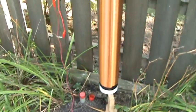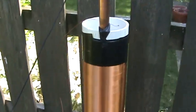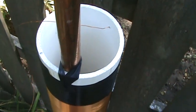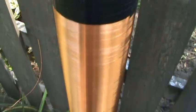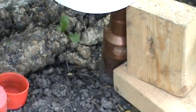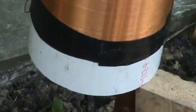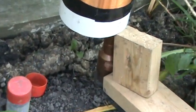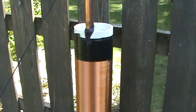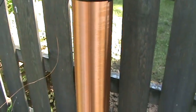There's another test I did today with the huge coil from my Tesla coil. You've got to make sure — because this is what our problem was — this pipe has to be positioned exactly flat up against the wall, and not only that, but it has to run straight through the coil. You see I've got the blocks at the bottom, that's pretty much just to avoid that little adapter at the bottom, that bottleneck. So we're keeping the coil exactly up against that copper ground pipe. And if I just move the position of this pipe at the top an eighth of an inch or a quarter of an inch, the voltage will change dramatically.